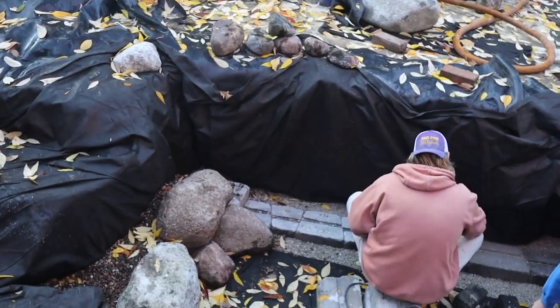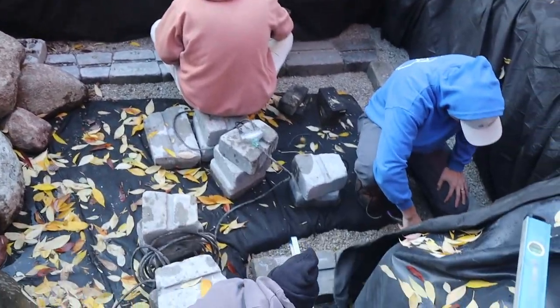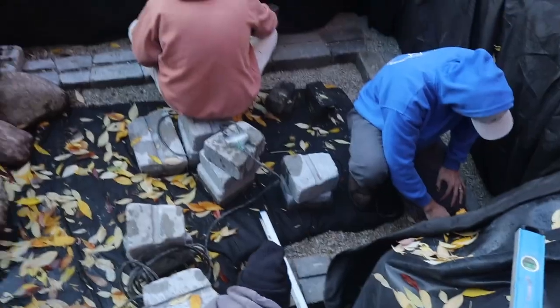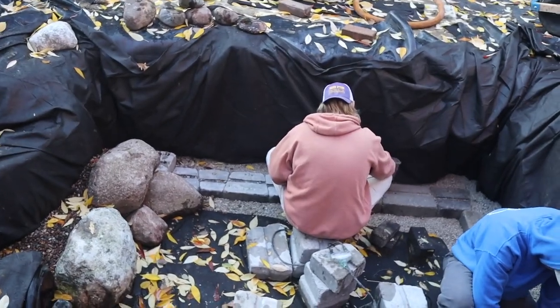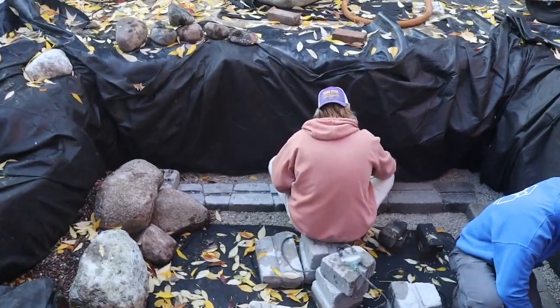So as you can see where you guys left off, it wasn't too far after I shot that last video showing you guys what we had done, but we were able to set probably 95% of the bottom course. Odie right now is just finishing up setting this wall right here, and then the other guys are just going around drying off all the bricks because we want that structure bond to stick to these bricks pretty well considering we're going down 30 inches.